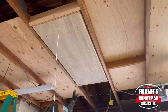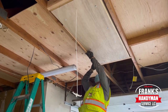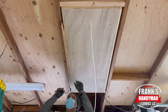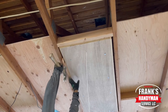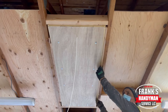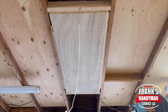Once you have all your screws in place you can go ahead and remove that support, but it also asks you to put in shims. We have a couple of long sections of shims that we're just going to put in the gap between the framing and the ladder. Once we put that in there, we're going to put those three inch screws through the attic ladder, the shims, and into the framing. This is the only area where the shims need to go — everywhere else it goes directly into the framing and the two by fours.